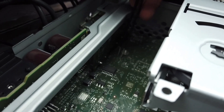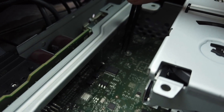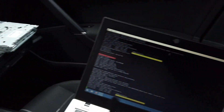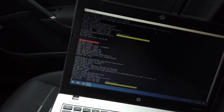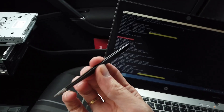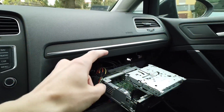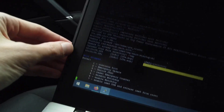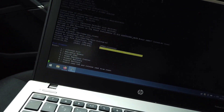I believe I need to take my tweezers and put them over these two holes. While they are shorted like this, you need to connect the quad lock connector to provide power to the unit. We should then see something different — right now we have a boot loop with a repeating message on the serial log screen. With those tweezers I should be able to trigger the emergency update procedure. I've powered on the unit with the shorted pins and I have an emergency menu with seven options — number two is emergency update, so I'm going to select that.